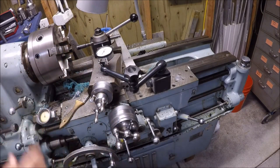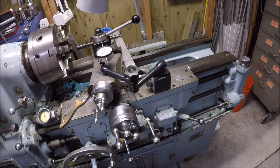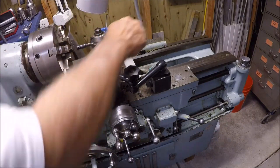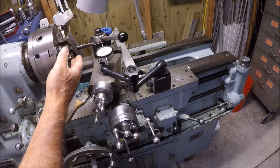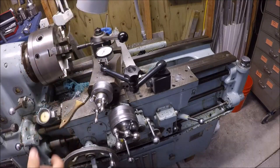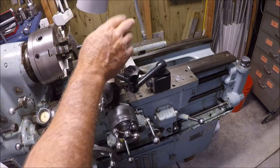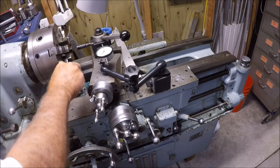As I was just coming over and put the lathe tool back in — in my comedy of errors — one of my times when I was threading one of those pieces, I think it was the steel, I put the tool in and didn't lock the tool in place. So as I started the cut, there was a large movement. I saw it on the dial, thought 'what the hell happened?' I still hadn't caught that I didn't lock the tool post. Those things happen — that's a bozo.